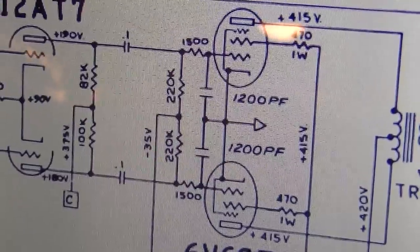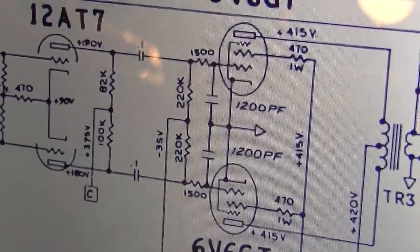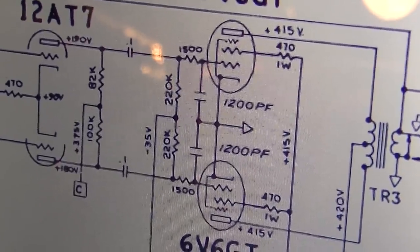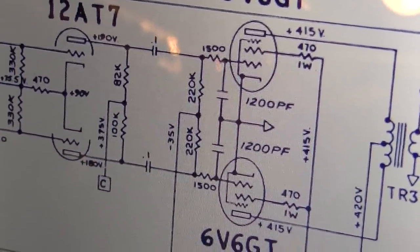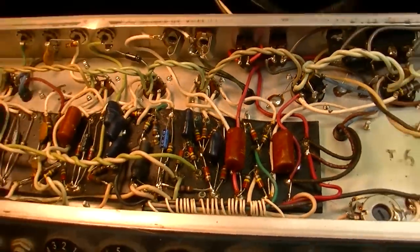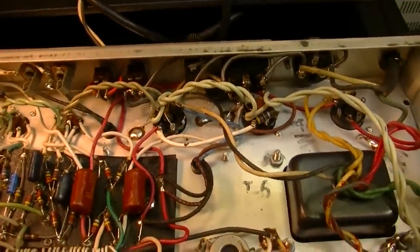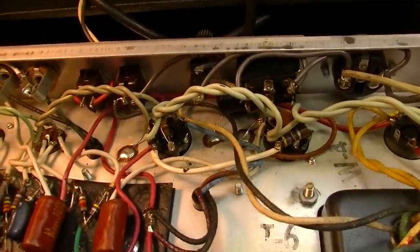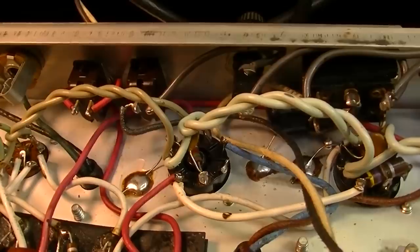So essentially what it's doing is giving this output stage a little bit of cleaning up. It's taking some of the junk out, taking some of the highs out. It's also probably stifling this amp's ability to go into overdrive. It's not a huge thing, but if you don't like these being so stifled, if you want a little bit more top end sparkle into that output stage, you can remove those.